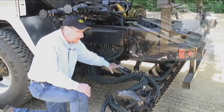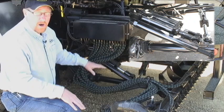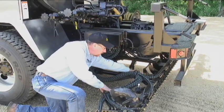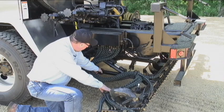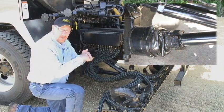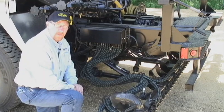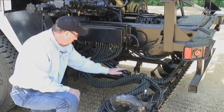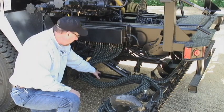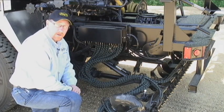What I have my hand on here is our bar carrying mechanism. It has stops at the bottom and stops at the top of a threaded rod so we can lower or raise this bar to any set position and know that it's set correctly. The other portion of this is our swivel joints — we have four of them, two on each side of the truck. These swivel joints have a boot around them; it's a ball and socket with an O-ring in it. The boots are very important to keep oil and chips off that ball and socket so we don't tear the O-ring and cause a leak. The union nuts on all distributors are there to tighten this pipe up. There's no gasket behind there anymore — there is a brass washer. If these start to leak, we just need to tighten them up. We now put set screws on them so once they're tight, we set the set screws and they should not move from that point on.